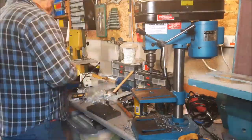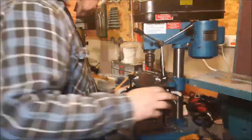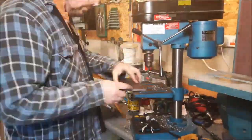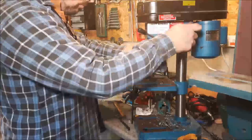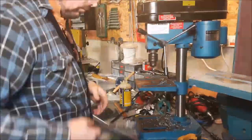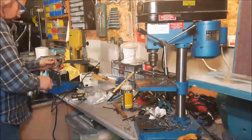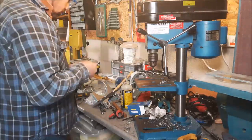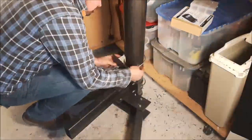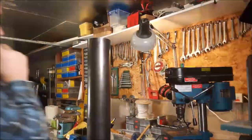I went through the whole process of tapping those holes and then realized I'd tapped the wrong size — M5 instead of M6. I got fed up with it so I just drilled them out. Then I got some transfer punches and used them to transfer the markings over to the second plate, but the ones I bought were useless because they were too soft and just blunted on the mild steel plate.